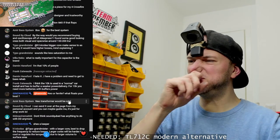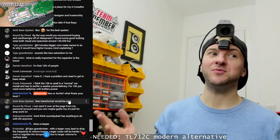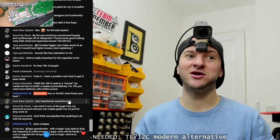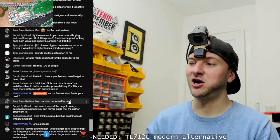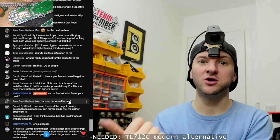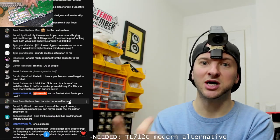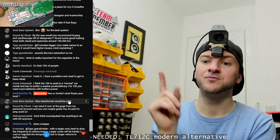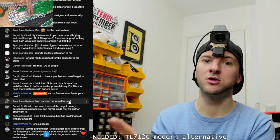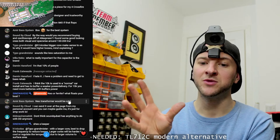Neo or ferrite, what floats your boat? Well, Neo, just for the old back. Although, I say that, my Z4 DDs, even though they're Neo, are not easy on the back. They're some of the heavier subs I've ever picked up. But yeah, I like Neo because it's much lighter, which is good for your car and your fuel efficiency and just general performance of your car. Less weight is better. You can still get the performance from the higher density, but the Neo is very delicate to temperature. You don't want to get a coil cooking at like 400 degrees Celsius in a Neo motor, because the Neo can degrade.